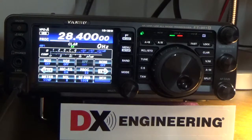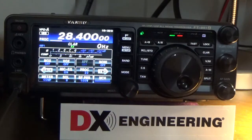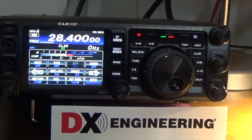Let's see what we've got. Transmitting: Kilo India 5 Juliet Uniform Foxtrot calling CQ 10 meters and listening. We're about where we need to be. If I turn the gain processor way too high, you can see it swings way too high — so we turn it down. At normal voice peaks we count 1, 2, 3, 4 and back down — we're between 5 and 10 dB. The processor is now set. We clear the processor from the multifunction key and we're back to normal.